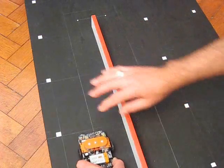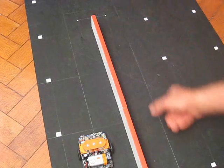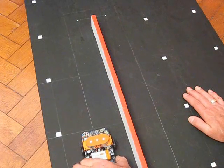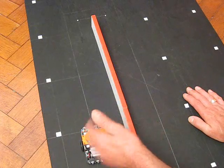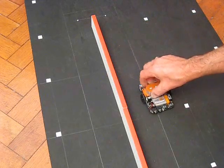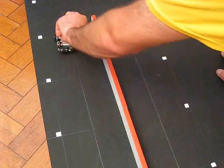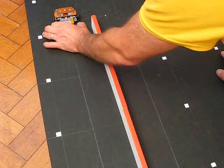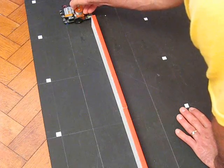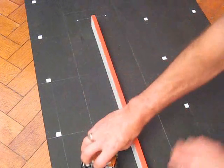I've now changed the centre square to F1. That will make the mouse travel up, round and back down — do a U-turn, come up, round and back down. This way we can test if it's straightening, using the right-hand wall straightening sensor going one way and the left-hand wall straightening sensor on the return, ensuring the mouse is running in the middle. We can also see with the white dots I've placed where the wheels should lock for the turn — whether the mouse overshoots or undercuts the turn, and whether the distance after the turn is correct, and adjust these accordingly in the program.